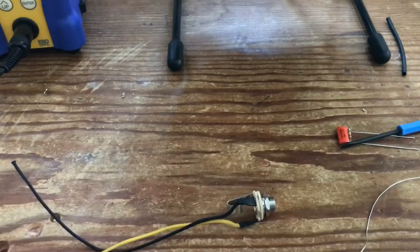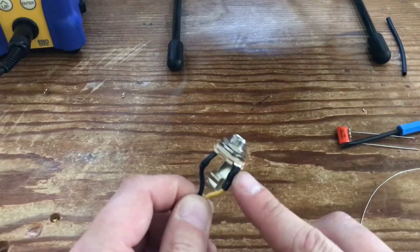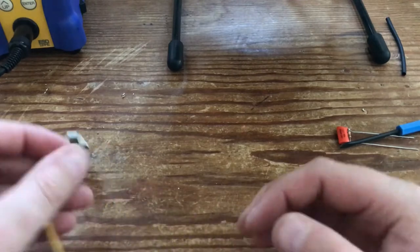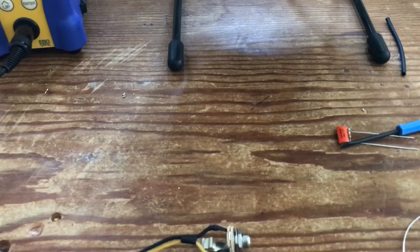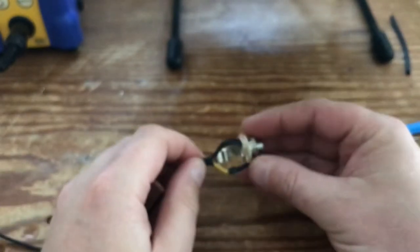The tubing is completely optional by the way — I just do it out of habit. But there is a reason: if you're using copper shielding tape inside the jack cavity and these unprotected connections come into contact with the copper, you're going to have a short, which you don't want. I'm just going to feed another bit of tubing down both wires and shrink that down.